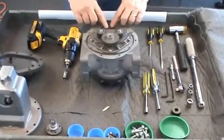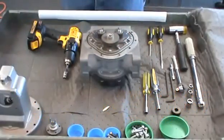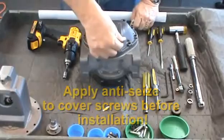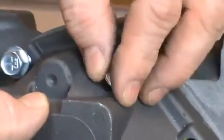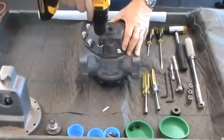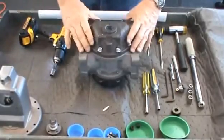Install the cover O-ring into the groove on the housing surface. Position and install the front housing cover with the half-inch screws. The front cover has a hole for the packing gland assembly. Be sure to apply anti-seize compound to the threads of each of the cover screws. These are self-tapping screws. To ensure proper alignment of the threads cut by the screw, turn each screw counter-clockwise until you feel it drop into the thread, then turn the screw clockwise until finger tight. Tighten the cover screws in a criss-cross pattern with a minimum of two passes. The first pass should be at half torque, with the second pass at full torque, approximately 66 foot-pounds. This method will ensure uniform seal compression on the cover O-ring or gasket.